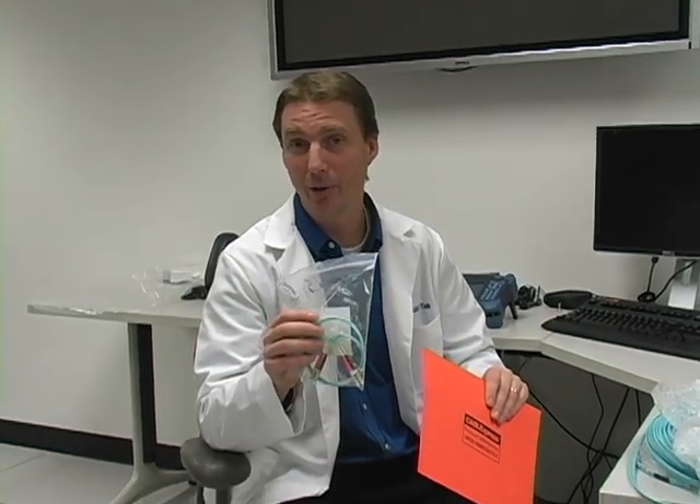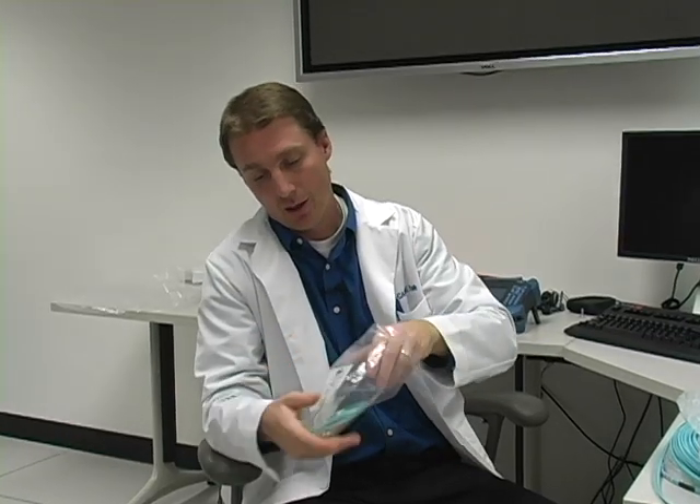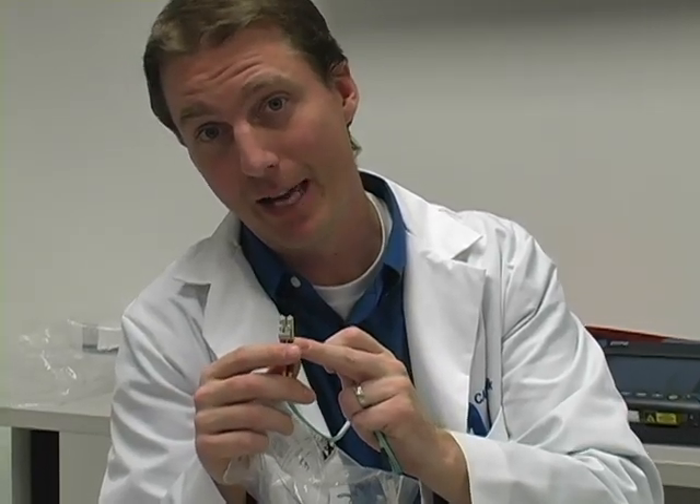If you don't have an approved area, make one. You could use a cabinet, you could use bins — you want it out of harm's way. Also, if there are instructions, take a read and follow them. They're there for a reason. When you do open them, only take off these protective end caps when you're about to plug it in. Otherwise, when you do, you have the end face exposed. If you just touch it, you're going to have end face contamination. Be sure to see CableTalk episode 23 where I go in depth on end face contamination.